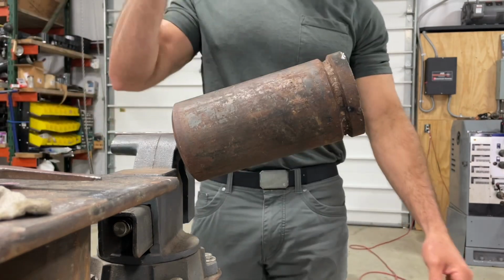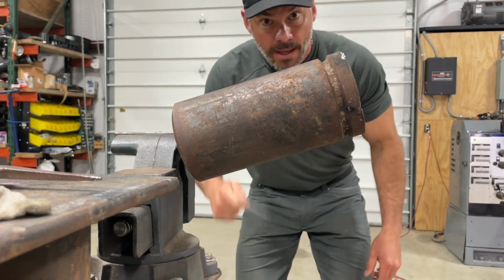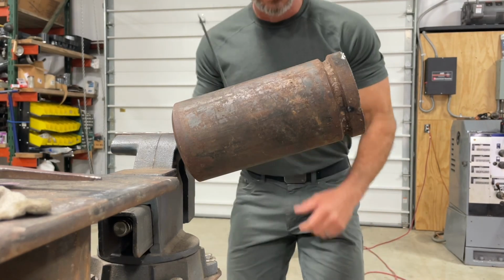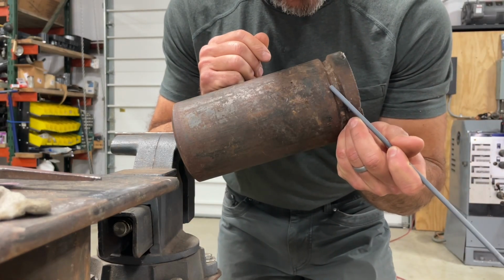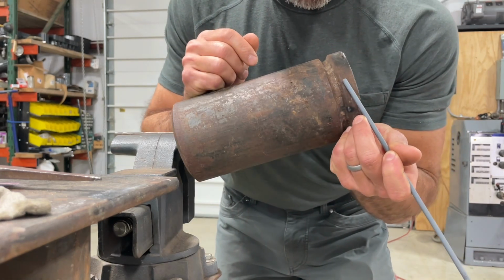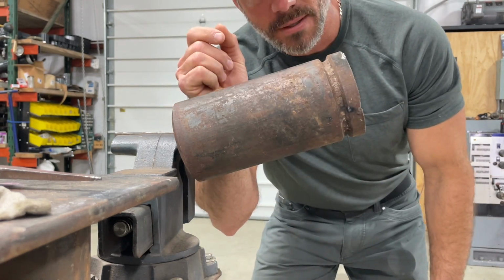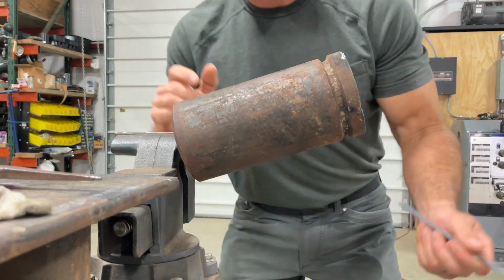I see this all the time. Listen, I see it all the time with people that have been welding forever. They fill it up too much. Don't fill it up too much. Do not blow those bevels off. If you blow that line right there and you fill it up too much and it spills over because you're running too hot and your bevel's that wide now, you've got to make a cap twice as big as it should be. Remember, weld small. Just try to remember that.